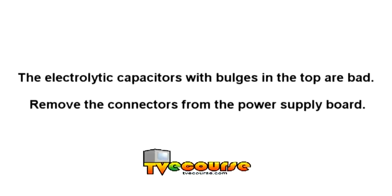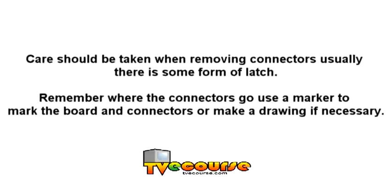The electrolytic capacitors with bulges in the top are bad. Remove the connectors from the power supply board. Care should be taken when removing connectors. Usually there is some form of latch. Remember where the connectors go, use a marker to mark the board and connectors, and make a drawing if necessary.